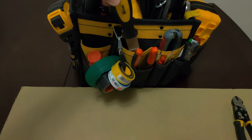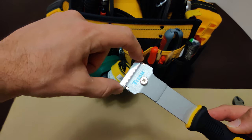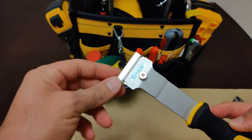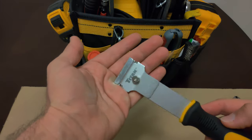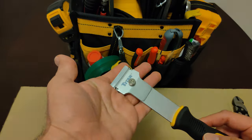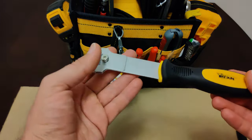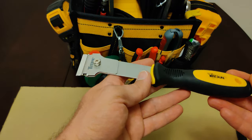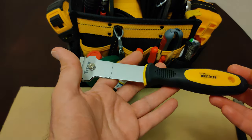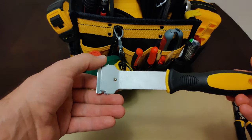In this pocket here we have a razor blade scraper tool. I've flipped this razor blade inside out in the opposite direction for storage, but when I'm going to use it I take the screw out and flip it back around. This is a very inexpensive tool which I normally use to scrape paint off windows and to clean hard surfaces such as tile. You can also use it to remove caulking and adhesives.